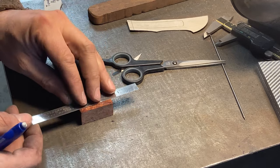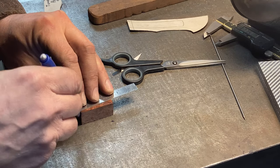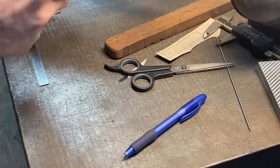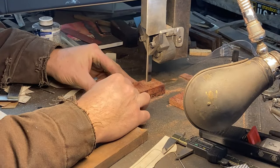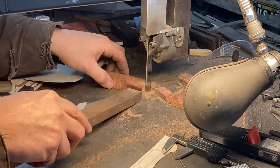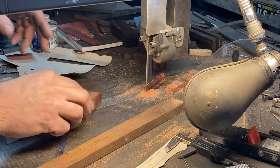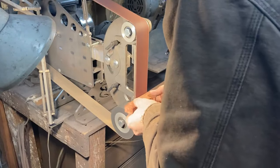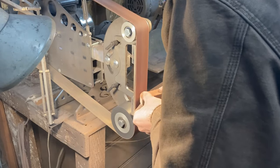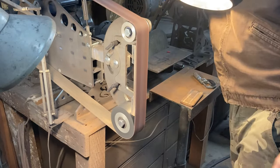Take a straight edge and mark across these two front marks that I made to match the angle of the back of the trim cap. Now I'm going to saw this first real quick and then we'll grind it later. Now we're just cleaning off the saw cuts with a 36-grit aluminum oxide belt. I need to make sure that the sides stay 90 degrees to the faces of the handle, so I'm just coming up in a loose grip, allowing it to index to the actual saw cut, which was 90 degrees, and go from there.